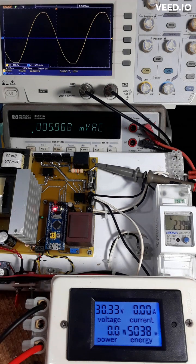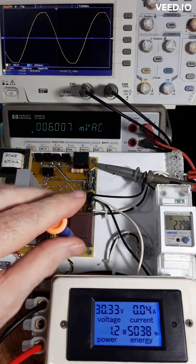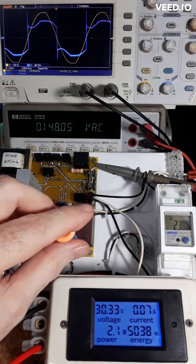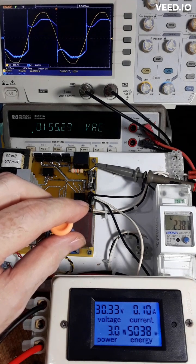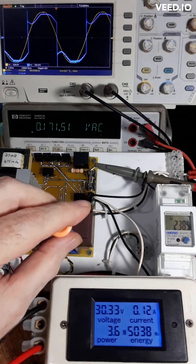I'm going to turn on the unit — unit is now on. With the relay off, meaning the load is not connected, I'm going to start to bring the power up. I'll show you the waveform. Bring this up and you can see this waveform is pretty square, then it rounds a little bit at the top. You can see that spiking on the zero crosses — that's due to the inductor. Because of the wave shape and the inductor, you get this spiking.